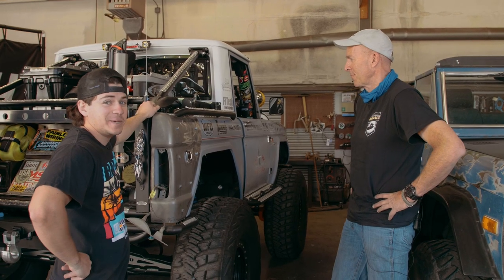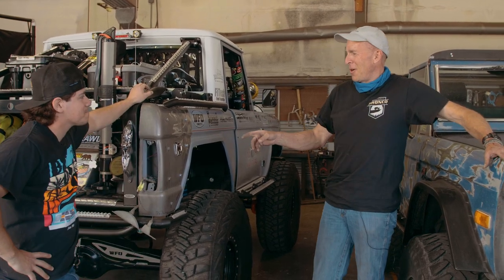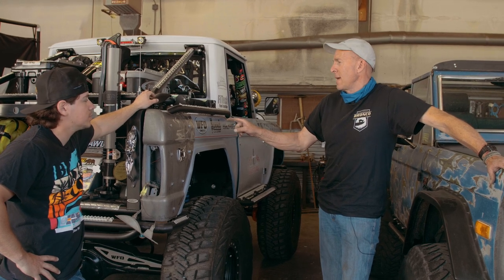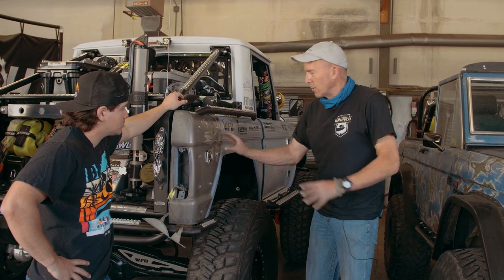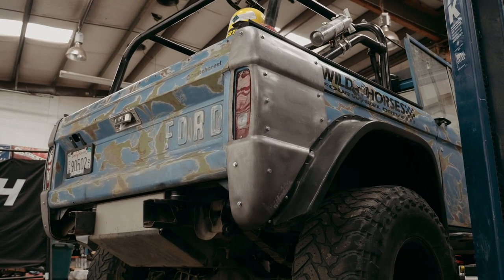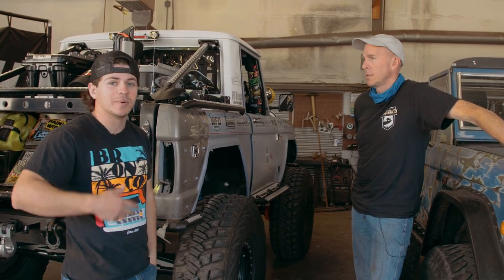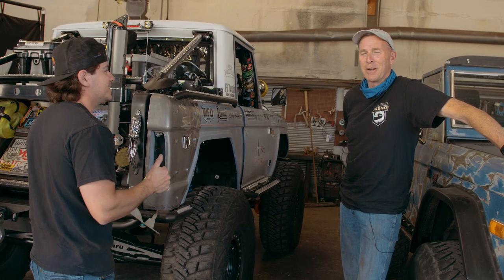All the holes have been drilled, and John has a special plan — that's why we were really excited. All these bolts are just temporary right now; I just wanted to get everything drilled and fit. What I'm going to do now is pull these off — I've already got a bunch of bolts with the heads cut off — and I'm going to weld them into each hole and grind everything smooth so you don't see any bolt heads from the outside. A lot of you guys have been critiquing the hardware — John's going to hide it completely. It's going to look like the Armageddon is just hanging there. You won't even see any of the hardware.